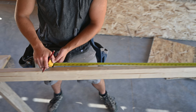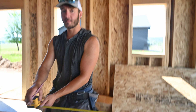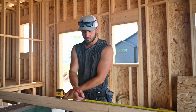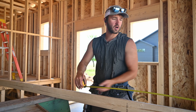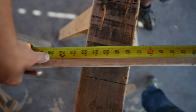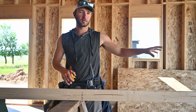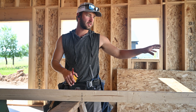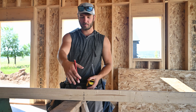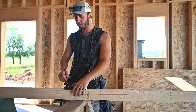We'll make a mark here and just keep going down the line making our 3¼ drop. This makes sure all of our trusses are two foot on center. You can put a bunch of these together, and excluding that first one because it's a weird spacing for the gable, you can just stack a bunch of these together and trace the marks with your square.